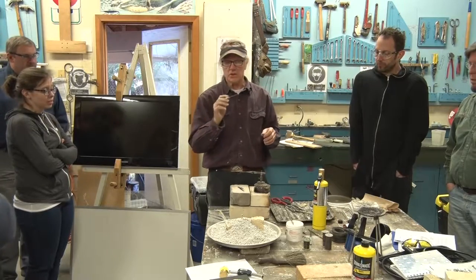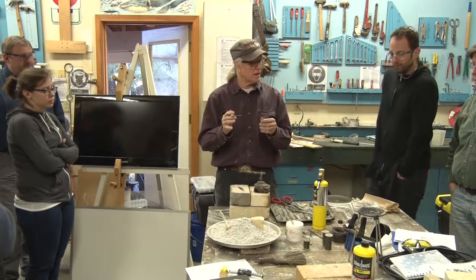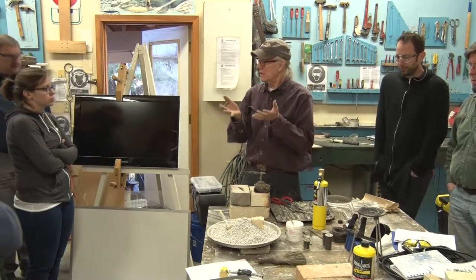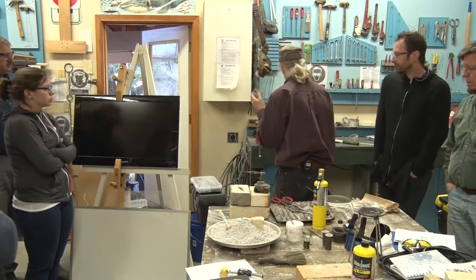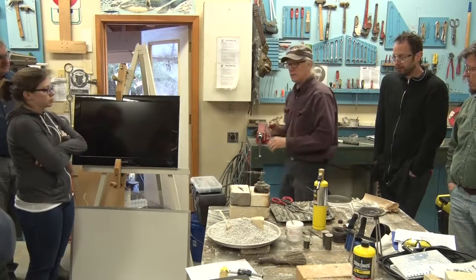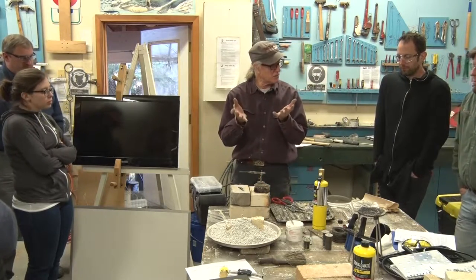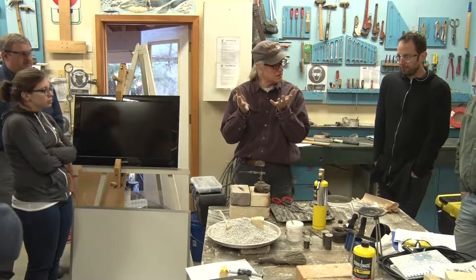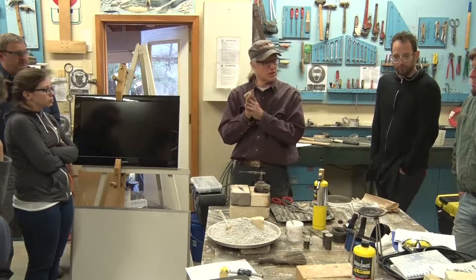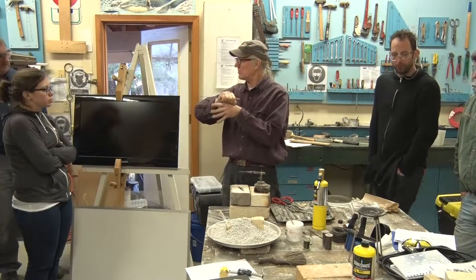So what you want to do is to heat up the larger piece first, and you're raising the brass up to this 1,200 degrees, whatever it is, 1,360 degrees. You're raising your piece of metal, your project, up to that melting temperature, and that conducts the heat to the solder. You're not melting the solder on, like so much glue on top of a cold piece of metal.